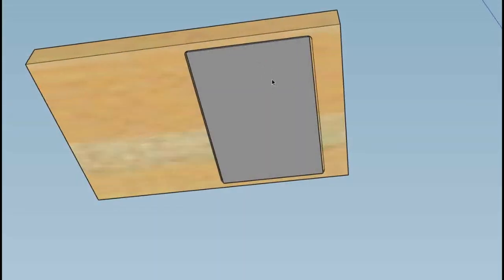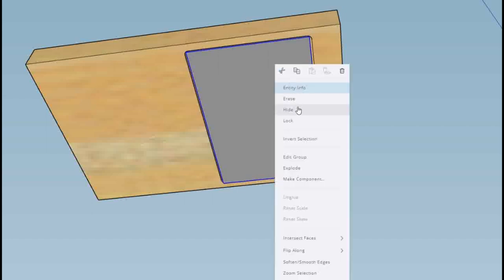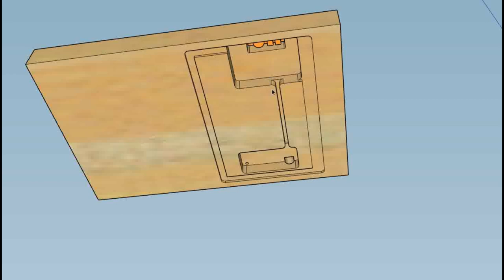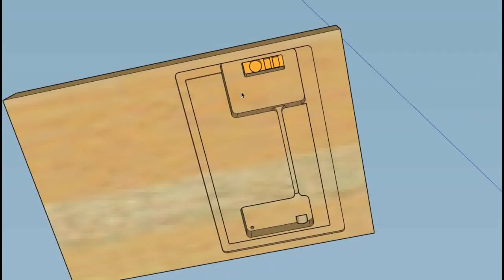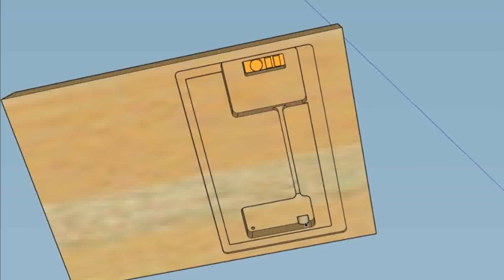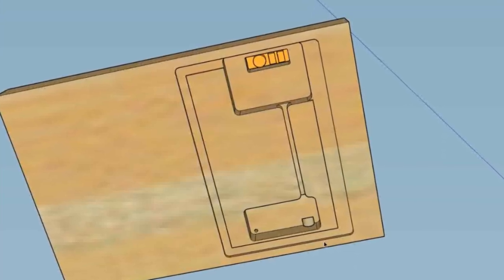This back copper plate will be for mounting the feed-through female connector for the DC power to go in. Underneath I'm going to put a little black metal plate — I already own this, it's from an old electronics project — and that's going to be placed on the bottom of the baseboard to keep all the electrics nice and protected. At the front here you can see the bottom of the switches and the speed controller. There's also room inside this pocket for the speed control PCB and on here will be the 12 volt to 5 volt DC to DC step-down converter. There's a little channel where I'll run the wires down, and in the back here will be all the room for the USB stuff, plus a hole to send the wires up to the motor and room for the wires coming in from the back panel.